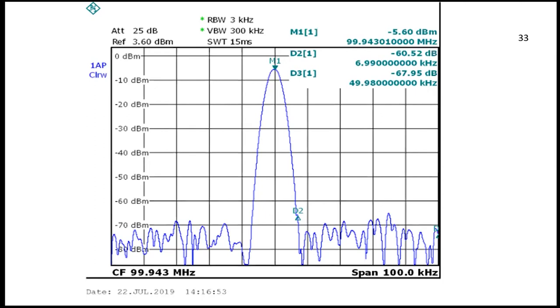Anybody got a source for a commercial LO, let me know — I may build another one. That little mixer was hard to beat for the price — $13 or something. The 8831 double-balanced mixer has good dynamic range. The object is to mix the 100 MHz local oscillator with the HF signal so you can feed it into the TV dongle. So for 40 meters I was looking at 107 megahertz. You can tune with software using the LO offset.